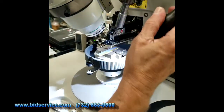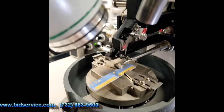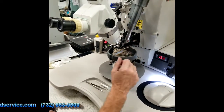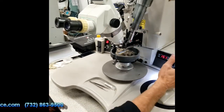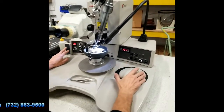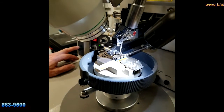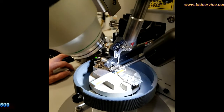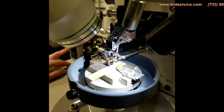I also want to show you that it does have the spotlight generator. If you can see the little green dot, it's a mark that shows you where the bond is that you're looking at. It's a spot, and what you do is you make a bond and then you can position your spotlight to that target. So we're going to do manual bonding — I'm going to use the microscope, look for a spot to bond, and when you bring the lever down, I can slowly do the first bond, let it up to loop, then move back and slowly position. As you can see, the bond head moves up and down with the lever. That's manual mode.